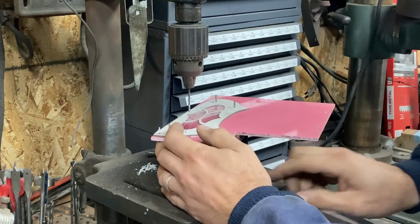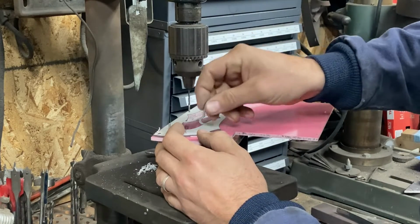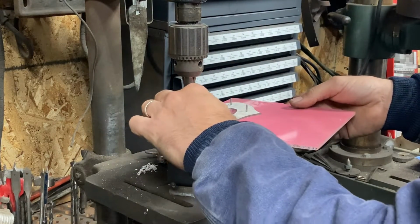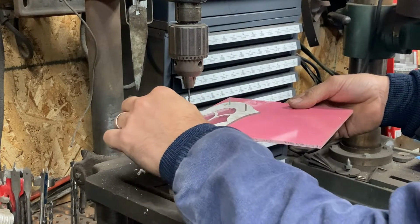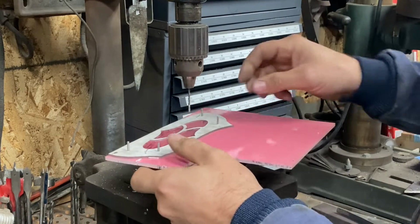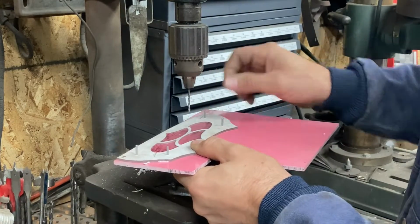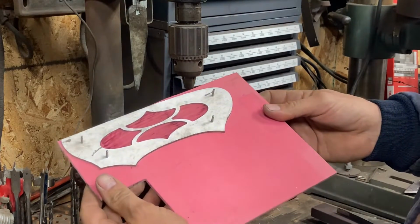And we want a tight fit. I'm using a 3/32 bit. It's sharp, and I'm using 3/32 pin stock, which is just a little bit too tight for these holes out of the package. So I've sanded them lightly just by hand with 600 grit until they fit easily enough to push and pull by hand, but snugly so that a piece can't wobble at all with even 1 or 2 pins in it. So that's good there.